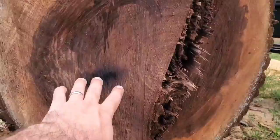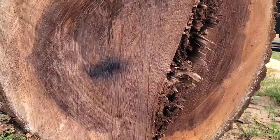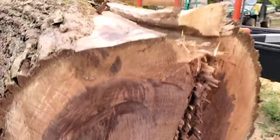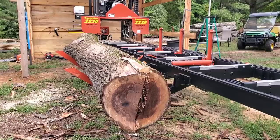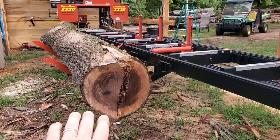And we're going to go ahead and cut through this. We have a carbide tipped tooth blade on here and depending on the orientation of how we cut this log, we may cut around it or we may cut through it. In part one of this carbide tipped tooth blade test, unknowing to me, in a 24-inch diameter hickory - which is kind of funny, it's about the same size log as this - I hit four nails. Did not know it, did not hurt the teeth. Now those were 16 penny nails. I don't know what this is. This could be a spike, this could be a little nail.